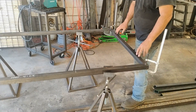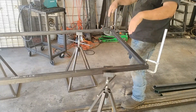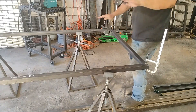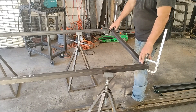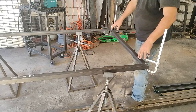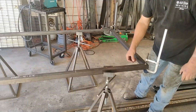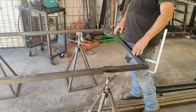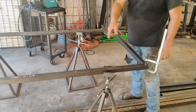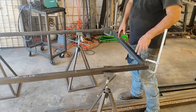I've got the door frame on my adjustable jack stand, so I've got it perfectly leveled both ways. I've used miter clamps to perfectly square off each corner, checked with a square — they are perfectly squared. I mean, couldn't get any straighter. Then I measured corner to corner with the tape measure. Everything's perfect.